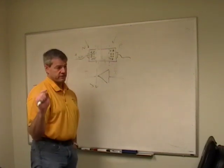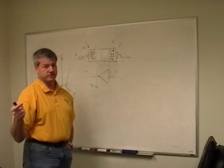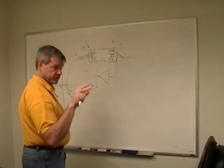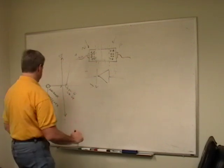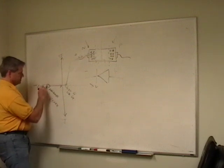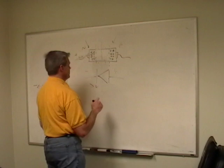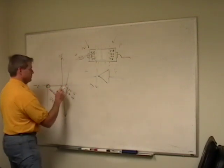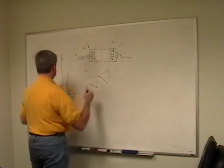If you use a regular diode and turn it backward, well, you can do it with the base of a transistor at about 8 volts or so, they'll start to conduct. And they'll become a voltage regulator because as the voltage goes more, you just get more current, and it doesn't take very far, and then you blow things up.